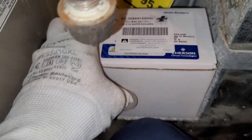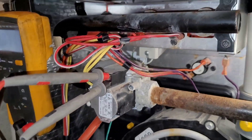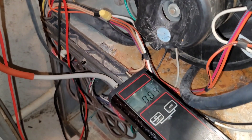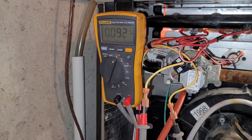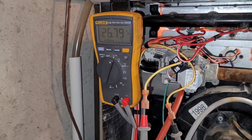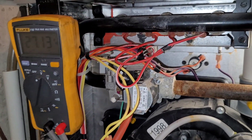That rollout switch is pretty rusty up on the burner, so I have a new one — it's got some resistance across it. But let's get to the meat and potatoes: change out the gas valve and get this furnace going. As you can see, the HSI is glowing, the manometer is reading no gas pressure as it sends power to the gas valve — bad gas valve. Here it is with leads on the gas valve wires: 26.8 volts. So we have another bad gas valve on this furnace.